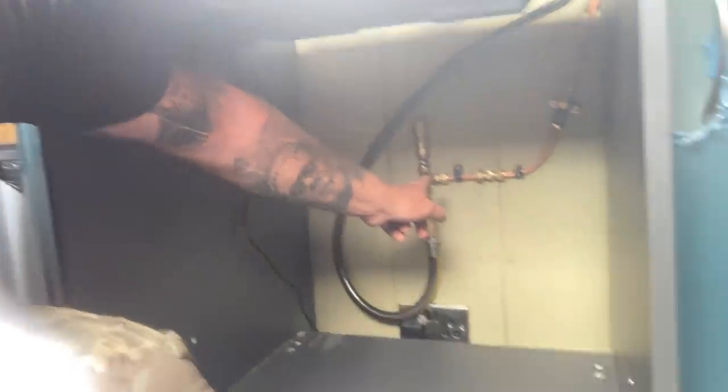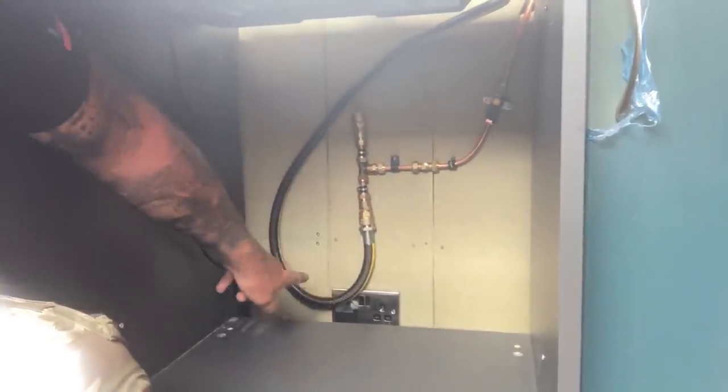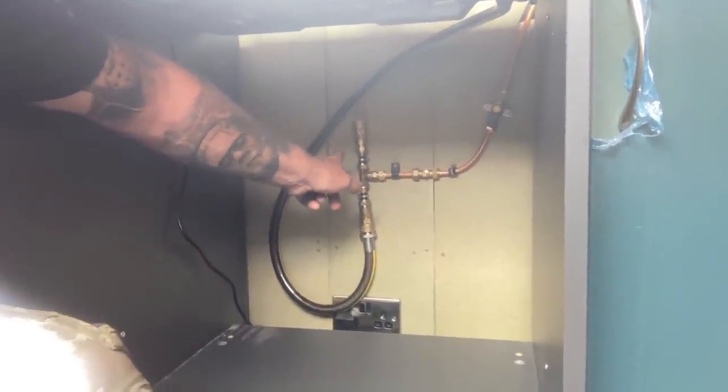So yeah, it's a bit grubby, the top of there, because it's not really been used, but here you go. Got to put some tiles along the back of there. Just peer down here a little bit. You can see it's all screwed up like it's supposed to be. Each fitting needs to have a clip on it at least 15 mil away. You see the hose going round to the bottom. Then that bayonet there will be for the top, the oven. But yeah, that's another step forward. I'll throw those jets away because I'm not going to need those. Another step forward, we can have a bacon sandwich. Next shot may well be us cooking a bacon sandwich on the boat. How about that? Here's hoping, eh?